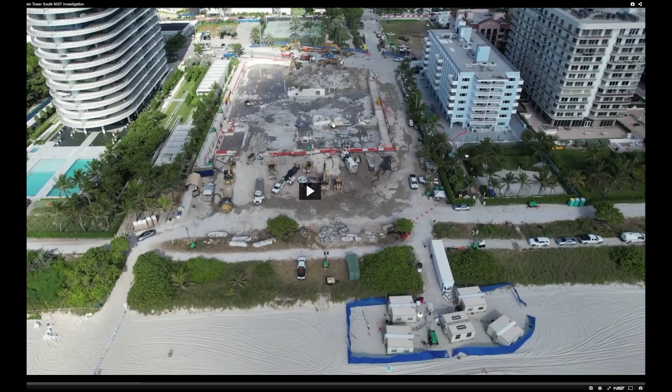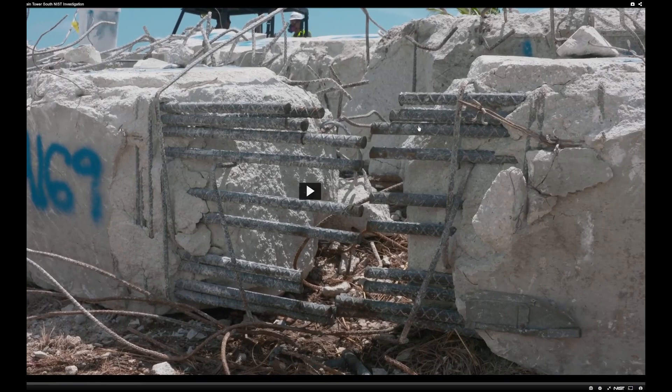This is what's left of that ramp. I want to take a look at something here because this gives me concern — what we might call overcrowding of the beams. I don't know if this is probably a beam, but these don't look like overlap rods. It's hard to tell if these rebars are overlaps or not. What I'm worried about is when I see them this close together, because they are not supposed to be this close. When you pour concrete, it needs a certain amount of space around it to avoid voids, to make it flow into place and obtain the strength it needs. When you have rebar rods this close together, this is a bad thing — actually forbidden by code. But I don't know if these are just overlaps for a joint.